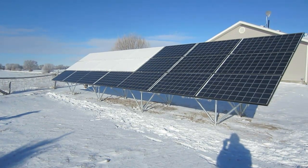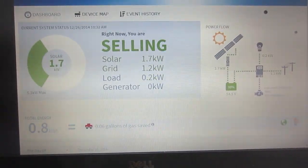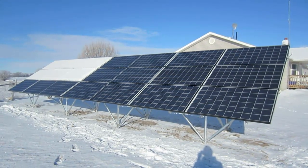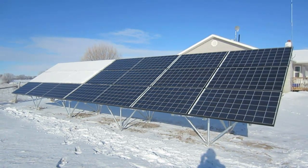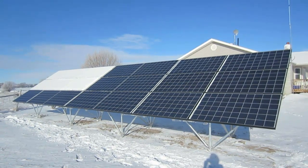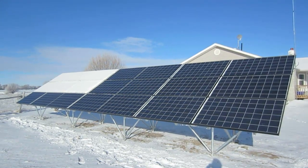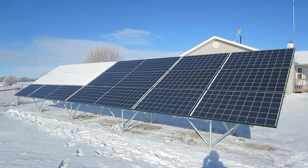I got the next row done. We're up to 1.7 kilowatts with nine of the panels uncovered now. And as you can see, we're selling to the grid. In order to closely match the charge controllers for the output of the electricity from the solar panels, we have two charge controllers on my system. One charge controller has three series of panels, and the other has four series of panels. Right now I have one charge controller completely uncovered, and one series of panels on the second charge controller uncovered. Let's go see on the charge controllers how much power we're generating, and then let's look online and see what we're doing.